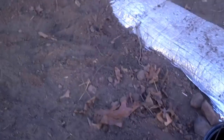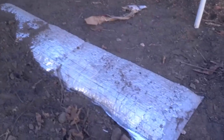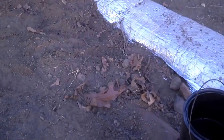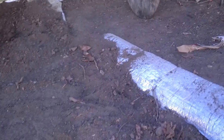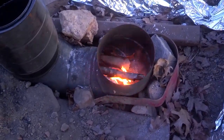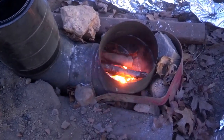This is a trench, or in-ground, rocket stove. That's all thermal mass. The idea is the ground is heated up right across there and you've got about eight feet of heated earth to sleep on when you're done. This could be a Walmart tent — it doesn't have to be a geodesic dome. It can be anything. It could actually be a cardboard box. Some people live in cardboard boxes — they could build a trench rocket stove and have warmth and no smoke inside. Build it right and you can see there's no smoke coming out of the burn chamber at all.